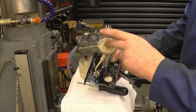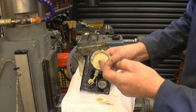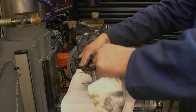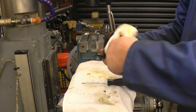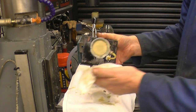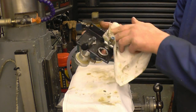It's a simple plunge pump with a strainer on the bottom. The strainer is obviously full of something — not quite sure what — looks like some sort of coolant residue, some sort of filter material. I'll get that out of there. It's like a felt pad — that'll catch any particulates. I'll clean the tank out, reassemble it, and run some nice clear oil through it before I hook it up.